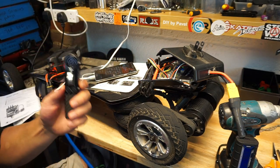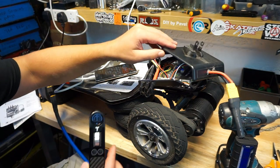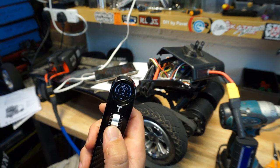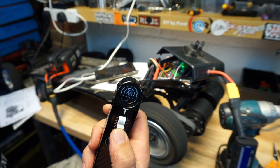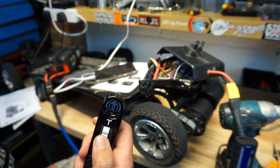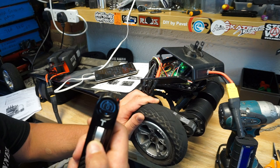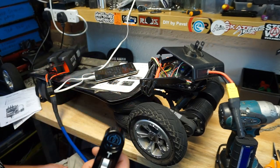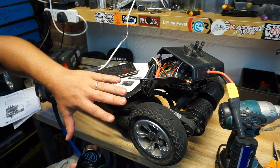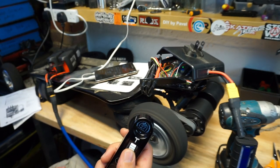So hopefully, now it's the moment of truth. The wand, Flipsky 6.6 Plus, everything done very quickly and using the phone. And here we go, 1, 2, 3, please work. And now we are spinning back, because this is the way the brakes are on here. Not just that the motors stop, they start reversing as well. So if you are on a really deep, steep hill, the brakes don't just stop the motors, actually giving it power to start spinning backwards. Awesome, awesome thing. So here we go, guys. That's it. The wand is operational.